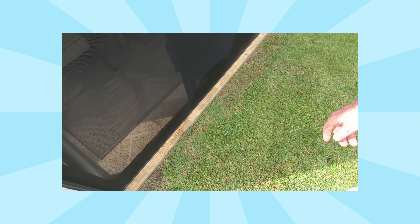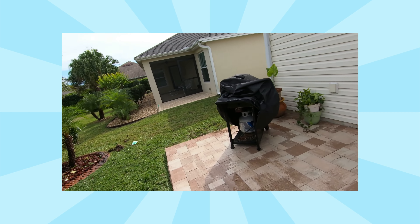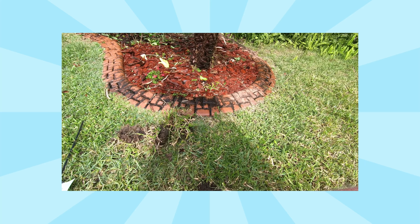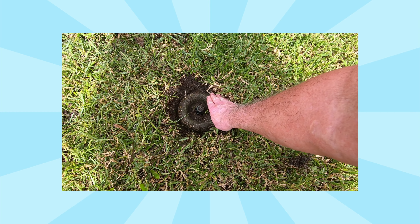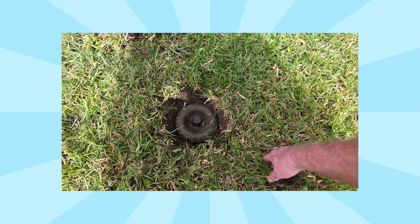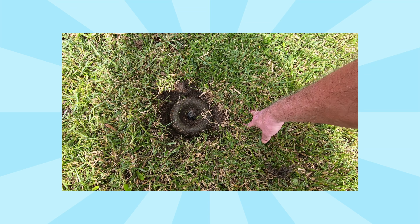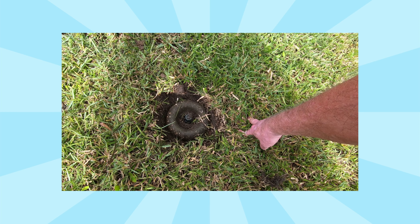The ones along here — I can't see them either, so I'll have to turn those on. This is just to show you some of the do-it-yourself stuff. When your yard is brand new, the bottom of the sprinkler head is up near the grass level, just below the surface. When a mower with heavy equipment drives over the top of this head, it puts pressure straight down onto the water pipe. It happened to me — they broke the water pipe at the bottom of the sprinkler head and I had to dig it all up and put a splicer in to fix it.